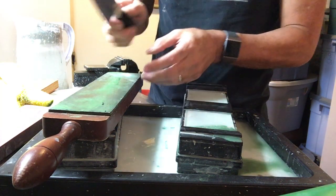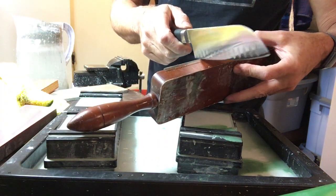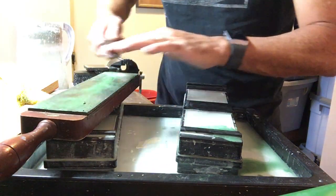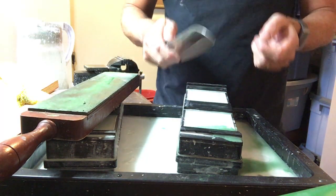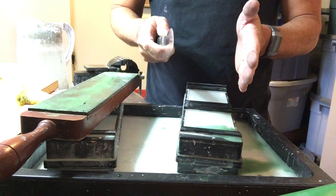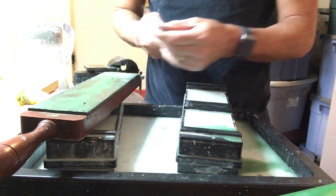So that's why, to get rid of that, you'll see folks running a knife over the edge of a cork or a piece of wood to clear that, and then they'll go over it, or even a stone or a fine grit stone to remove that wire edge. You have to remove it. So remember, the wire edge, if it forms, is something that forms at the end of the process. You also cannot see it under a light.